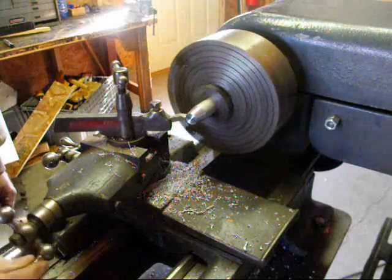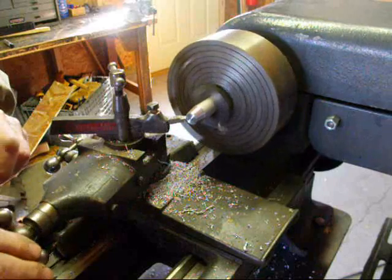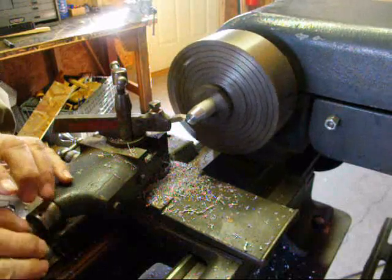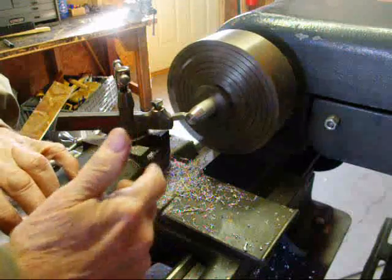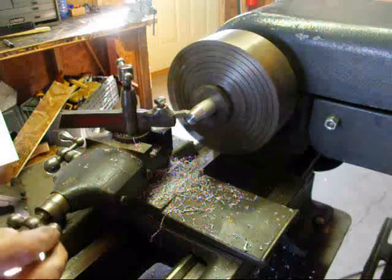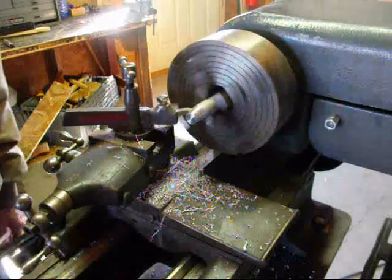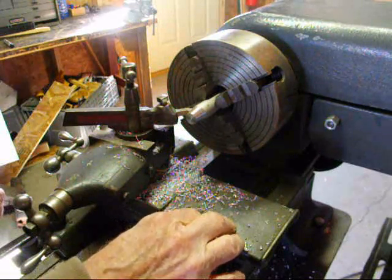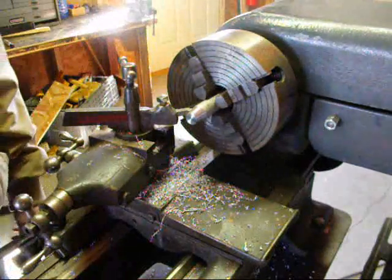Now I'm going to take a finishing cut and just feed it in about five thousandths or so at the cross-feed, and I'm going to turn in very slowly. This is also a method you could use to re-sharpen your sixty-degree lathe centers using a carbide tool, setting this for thirty degrees, which is half of sixty. If the center is not made of high-speed steel but just carbon steel, you're going to be able to do that with some success. This is also the method you will use with a tool post grinder to grind your centers — mount the tool post grinder here instead of the tool post and feed it, and we can true up our sixty-degree centers.